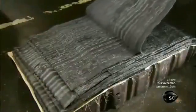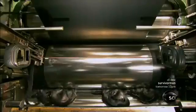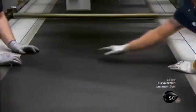For most parts of the tire, they reinforce the rubber with nylon fabric. The machine heats and kneads rubber slabs until they melt, then coats both sides of the material with a molten rubber. When the fabric-reinforced sheet of rubber cools, the machine slices it into pieces of a specific length, making the cuts at a diagonal called a bias angle.